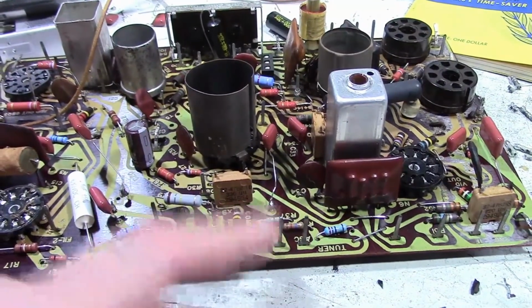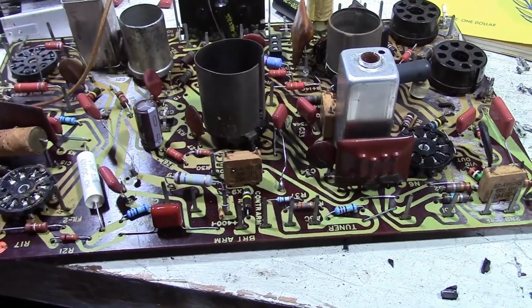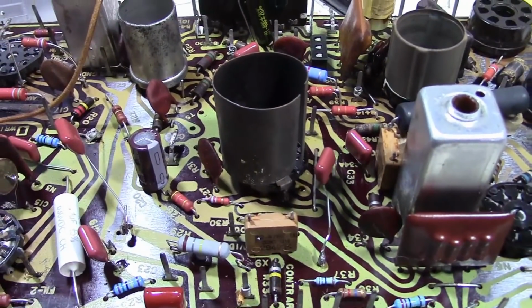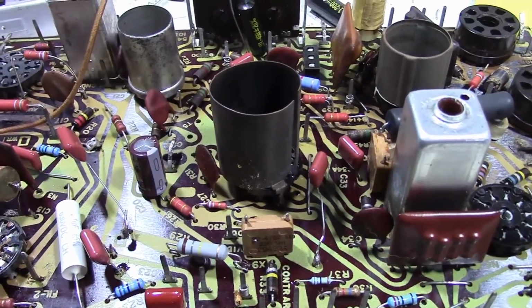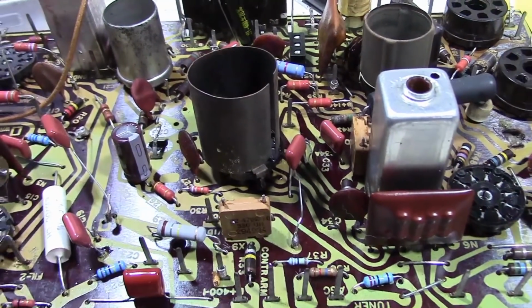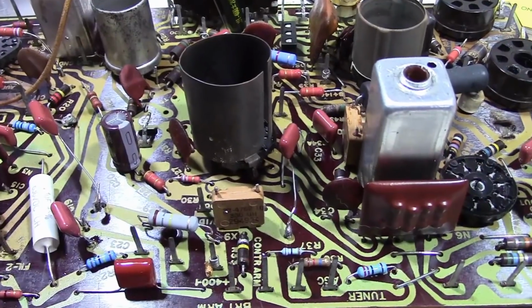These will tend to blow out if they get a current surge, whereas carbon comps can kind of suck it up and dissipate it, so to speak. So that's why I believe they're still made, but be prepared to pay maybe $1 a piece for them, and you may have trouble finding 2 and 3 watt. But half watt, yeah, they do seem to be fairly available.